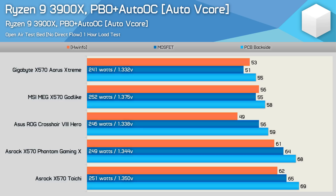Out of interest, I re-ran all the tests again with the voltages and LLCs set to auto with PBO Plus Auto OC enabled. This dropped the temperatures by 1 to 4 degrees depending on the board and where we were measuring. The Godlike and Hero were again very similar, while the Extreme was 3 to 4 degrees cooler. Again though, we see the ASUS onboard temperature probe was reporting temperatures significantly lower than what we measured using our thermal probes, whereas MSI and Gigabyte seemed very accurate.